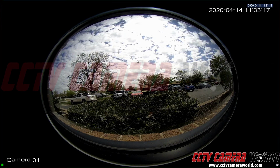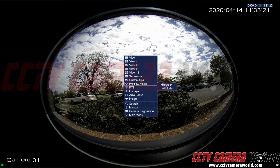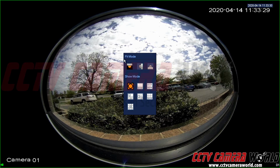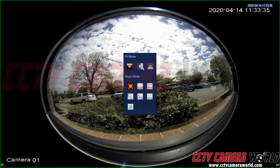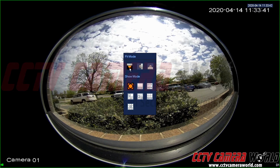In order to get to the dewarping, we're first going to right click on our channel. It's going to bring up the menu here. We can see between PTZ and autofocus we have the fisheye. Now this is going to bring up the fisheye menu. At the top we have what's called the fit mode, which is basically just your installation mode. We can see we have a ceiling mount, a wall mount, or a flat surface mount such as a countertop or a table. So we can kind of cycle through these modes really quickly.